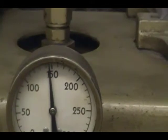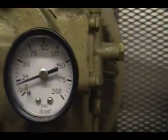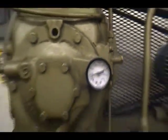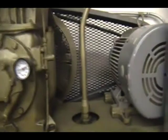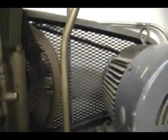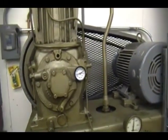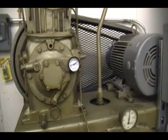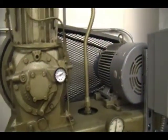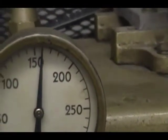Already about 145. Currently operating at about 20 PSI oil pressure. I can see I could tighten the belts up a little bit — they are a little loose. I suspect they're going to stretch out after a while, but I'll leave them for now and re-tighten after I get a few hours on it, since this compressor hasn't run that much since I put the new belts on. There we go — 160. Alright, now for the moment of truth.